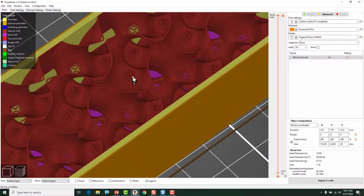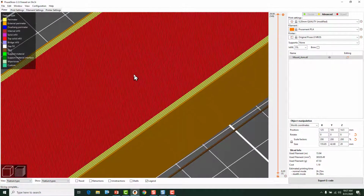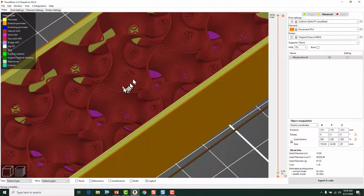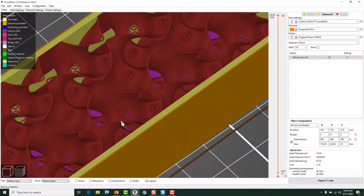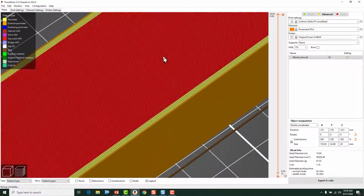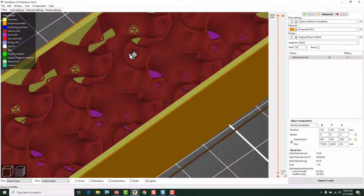If we get down there and look, it's going to be putting these layers across a lot of big open gaps. Like there's a piece of filament right there, and then there's a piece right there. And so if I look, that's a pretty long travel path. It's going to be in air and then catch right there and then be in air and then catch right there and then be in air all the way across to right there. And what you're likely to see with one top layer is that these pieces right in through here and some of those long areas like that, they're going to sag and it won't look right. You're going to see that gyroid pattern show through, and it's not going to be something that you're happy with.